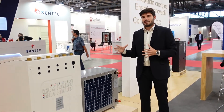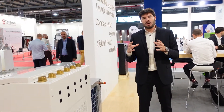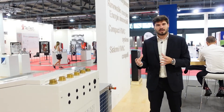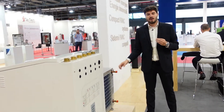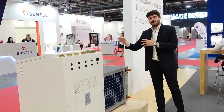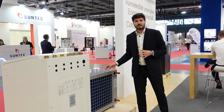The last advantage in this kind of system is the HTR technology, which combined with the defrosting technology is quite interesting. The HTR technology of the EcoGeo Plus heat pumps allows simultaneous production of domestic hot water and heating in winter. This means we can overheat the domestic hot water tank, so when we need to defrost the outdoor unit we are consuming overheated water. When the heat pump restarts, it doesn't need to produce domestic hot water again but resumes heating and overheating the tank again. The overall system efficiency is much higher than any monoblock or bi-block system on the market.